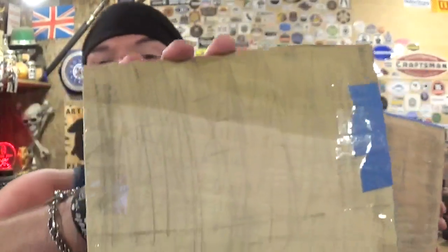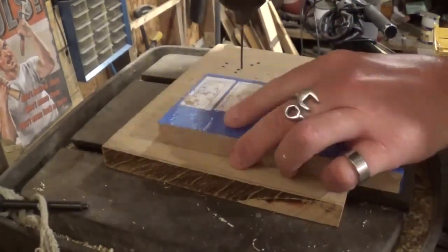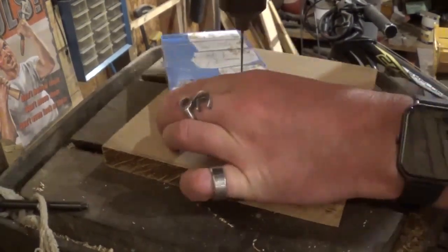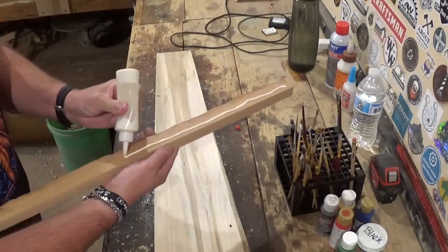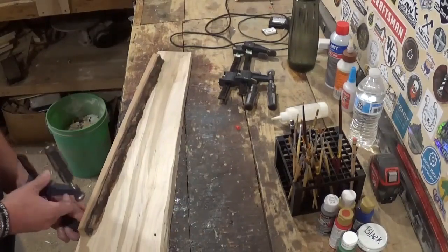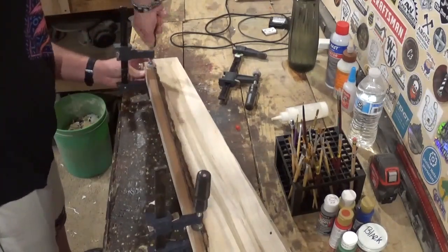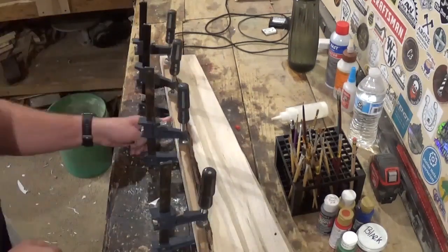Since these pieces need to be on their face side at all times, I've scratched a number two pencil mark on the back of each piece to make sure they stay right side up when shaping and contouring. Now that everything is prepared, we head over to the drill press to drill the pilot holes, then come back to the scroll saw. There are only three actual internal cuts in the project. Before scrolling, we'll also take wood glue and glue the live edge strip to the ambrosia maple so it can dry while we work.